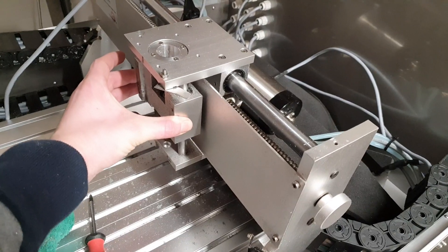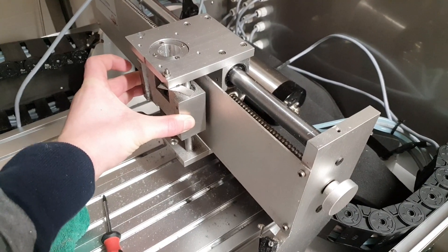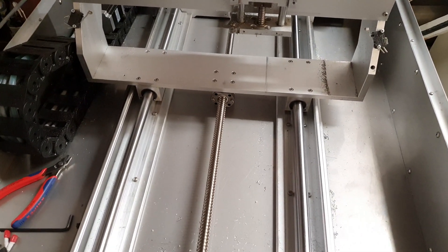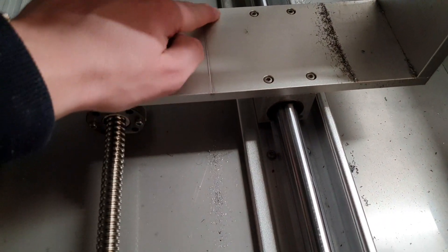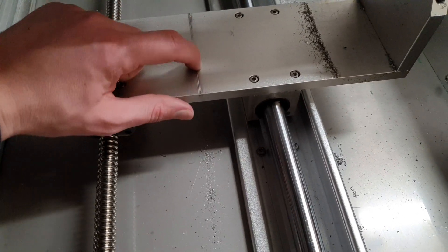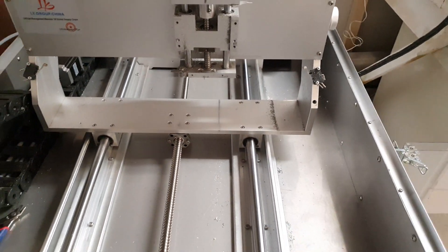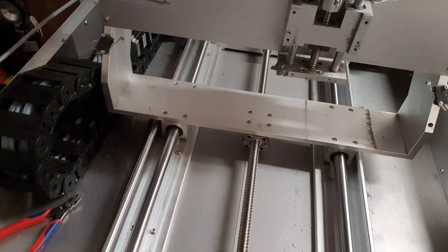The router is now on its way down and I've been looking around for backlash issues. This little Z axis seems to be the worst — this ain't good at all. I removed the T-slot aluminium plates that work as the milling table, and interestingly one of the T-slot profiles had engaged with the base plate of the gantry, which might have slowed my NEMA 23 down some. Not as many chips inside here as I thought.